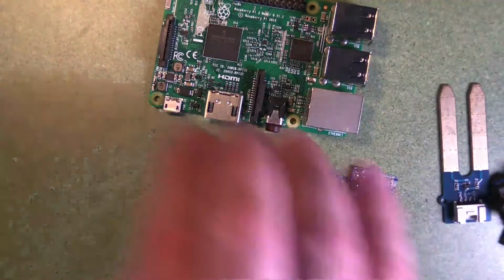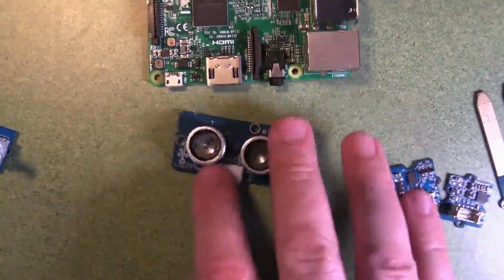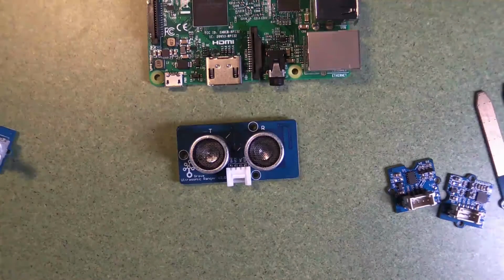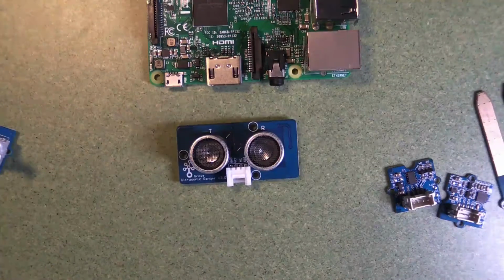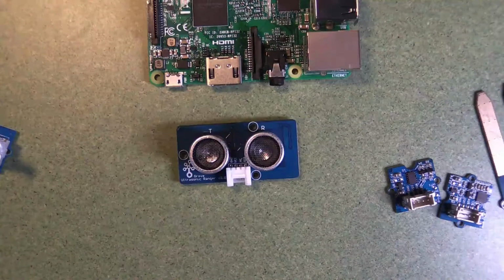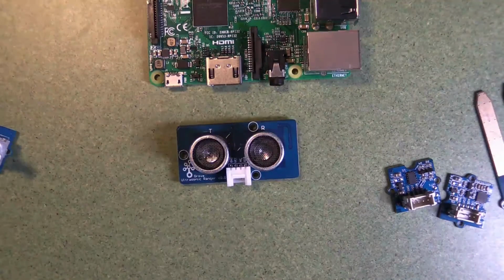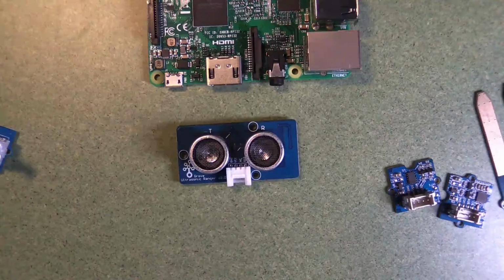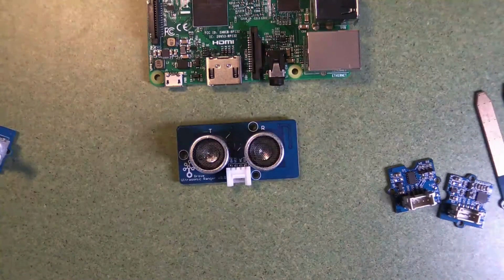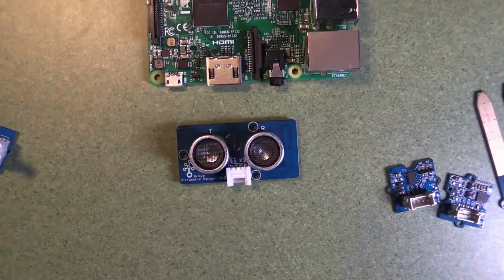So we're not going to send out 3 voltages, we actually use a digital signal to communicate those numbers. And over here we've got a distance sensor. This is an ultrasonic distance sensor. This sends out a pulse and waits to hear the pulse back. So this is kind of a bit different. It is sending digital pulses, clicks, and then receiving those digital pulses back by using its microphone inside there. And by comparing when it's sent and when it received those pulses digitally, by using numbers, it can calculate the distance to any surface that it's pointed at.